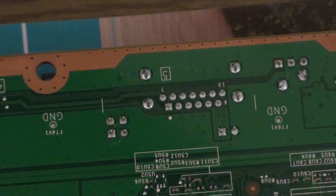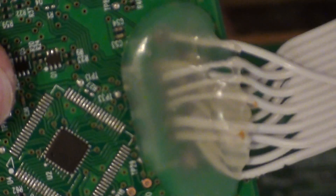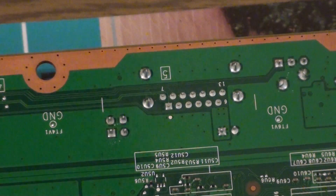Anyway, so you're looking at this in reverse. So once you've soldered the ribbon cable to this, you want to split it into the rows of pins. There's six on the top and seven on the bottom. So you want to do that with the cables — so that's the seven — and you just want that to correspond with the motherboard down here.